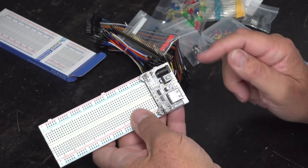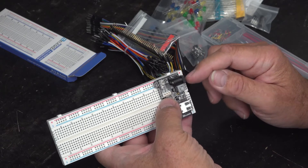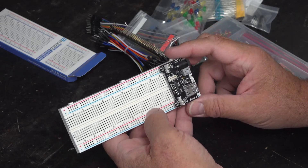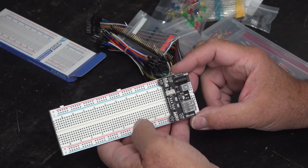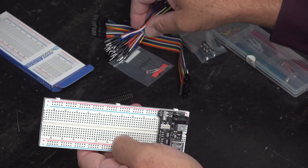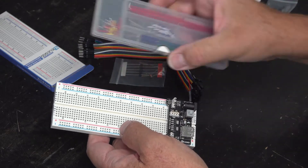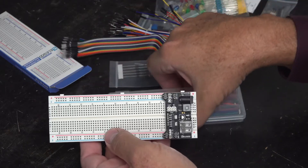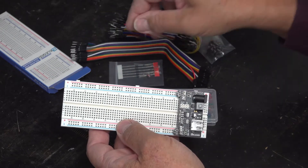There's a convenient USB output as well. Typically at this point you would put in 12 volts, and you would get 5 volts regulated out plus the USB output. There are LEDs on here as well that light up when you turn on the device. The flexible jumpers allow you to jumper across the board or from external devices into the board, while the rigid jumpers allow you to put down hard wires for finalized circuits.